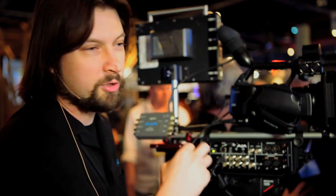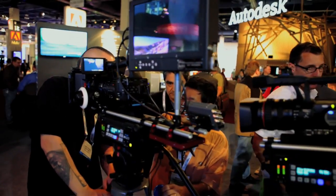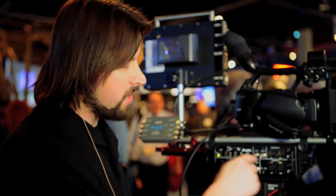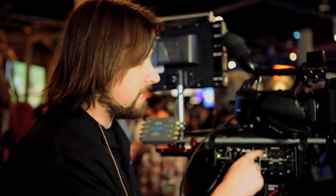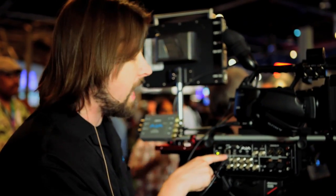So you'll notice on the booth there's a wide range of cameras. Canon HV30 is just a little prosumer camera, all the way up to this fully tricked out Sony EX1. So basically, the other items we have are LTC in and out, so we can emulate the code coming from the camera, or we can get it from embedded timecode if the camera has it.